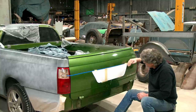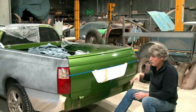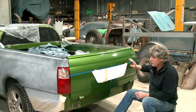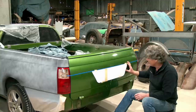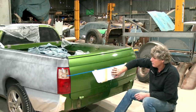And we've also got enough room that we can get in here and finish that weld. So we can grind it all the way around there if we're using the MIG. And I will use the MIG for this job, just because it's so quick and easy. A TIG welder would be better because you're going to have better control of your heat as you do it, but by no means necessary. Now, this panel that we make to go in here will have to be folded naturally,